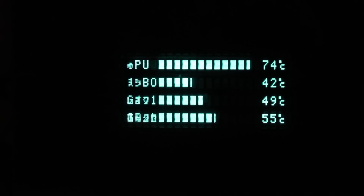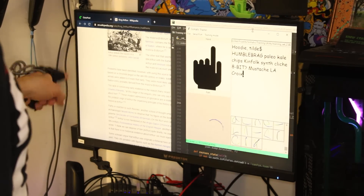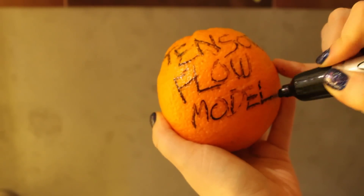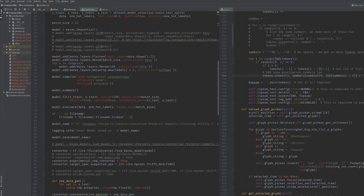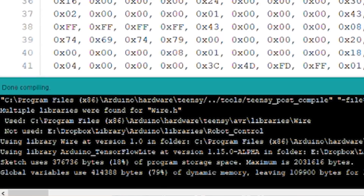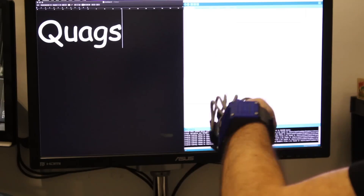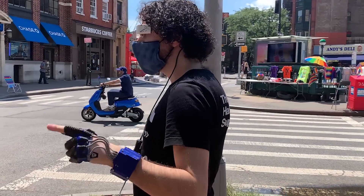10 milliseconds? TensorFlow? 600 nodes? Believe it. This is what people trying to scam money out of venture capitalists call machine learning on the edge. It takes a lot of resources to train the neural network, but it doesn't take nearly as much to run it. The input is a database of over 10,000 handwriting samples that I personally painstakingly built over hours and hours of wrist-destroying training. I used TensorFlow Lite for microcontrollers to compress this into an adorable baby version that fits on the Teensy, runs really fast, and works almost as well. The output is — and I shit you not — a C++ object declaration that I copy and paste into my Arduino sketch. It takes up a mere 20% of program memory and 80% of RAM, but it lets me run machine learning on a glove. The result is I can draw in midair using my regular handwriting and it sends it straight to my wearable computer. If I'm in public, I can make the gestures small and stealthy, and if not, I can make them big and flashy. As I use and train the system, it'll get more accurate and more full-featured.